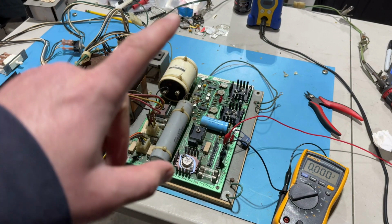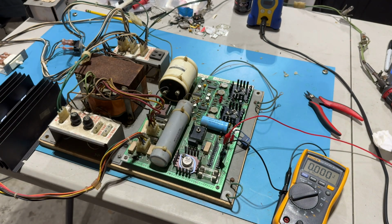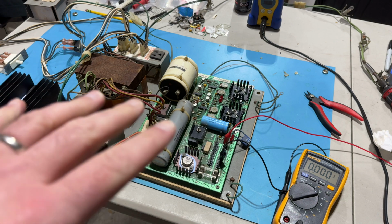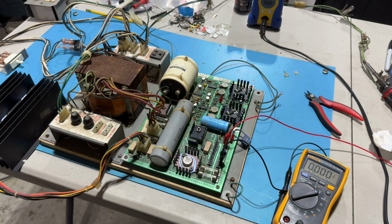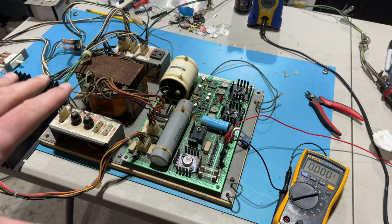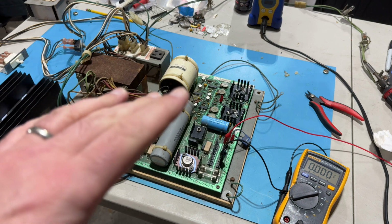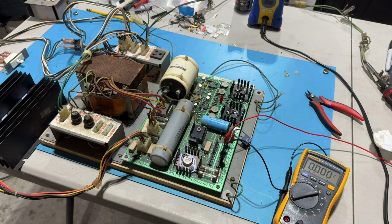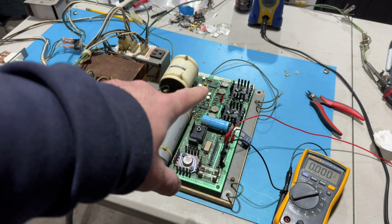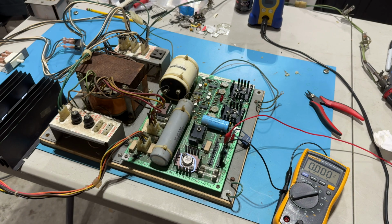Okay, after I cut away, I hooked up my multimeter to the headers on the 5 volt and the 12 volt lines. -5 and -12 are great, so that circuit I think is doing okay. The +5 was actually around 1.4 something, and the +12 was like 4 and change. So that would explain why the 12 volt LED was dim and the 5 volt was out.